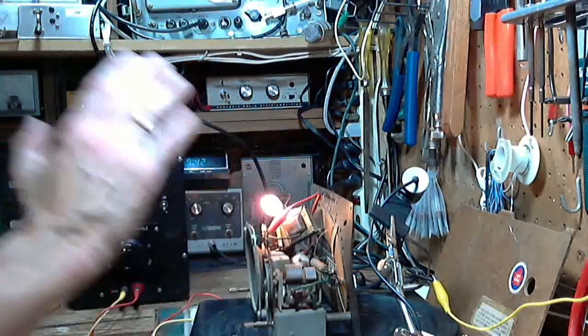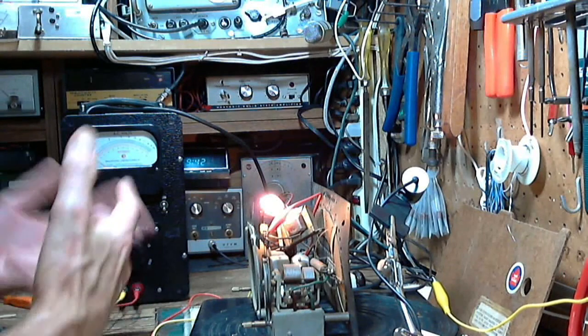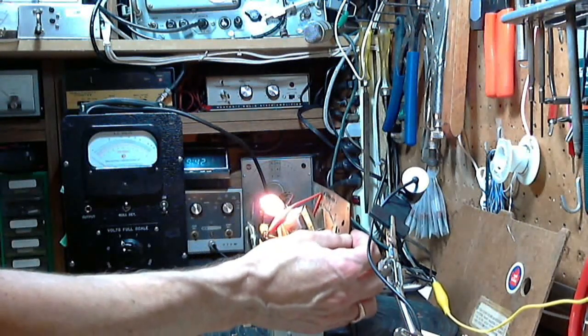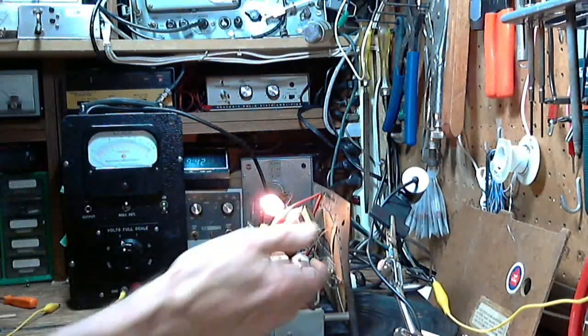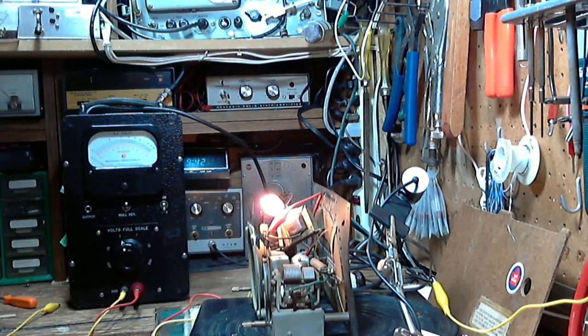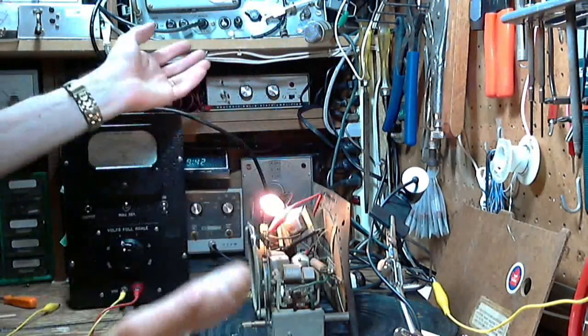And these antennas are regularly messed up, because when a person's fooling with the radio, they'll often remove the back here. And you can see this is really not meant to have the back removed from the radio chassis. But people will do that. Even I've done that, because you don't know what you're doing when you first start on the radio. You remove it. Next thing you know, you've pulled the wires off. If you have no experience, you don't know what's going on. You might think of an antenna as just a piece of wire. So I'll just hook this wire up and it'll play.